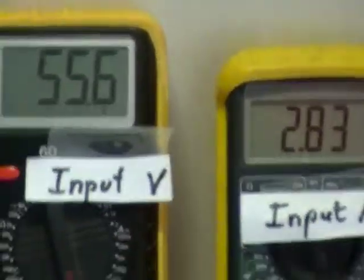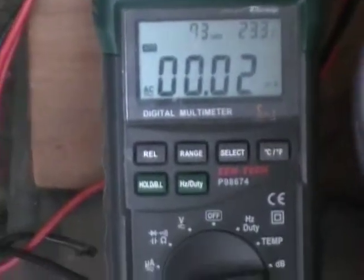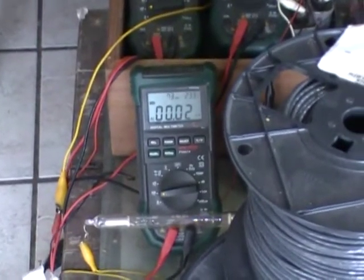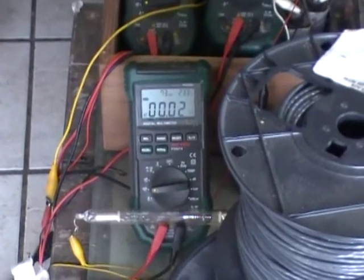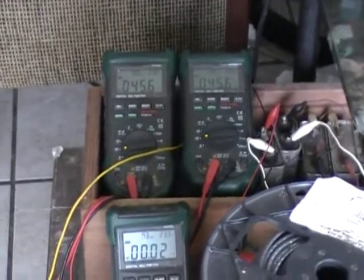We'll go ahead and note our secondary action. There are no bulbs being lit, and when it lights, the other end of that meter will show the other end of the circuit — formerly the plug that plugs into the wall. It has been shorted across that meter, and when the neon lights we'll get amperage through that bottom meter. We got roughly 45 milliamps on each side.